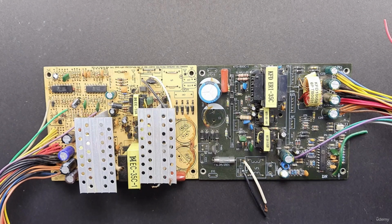The first step is to turn off power and discharge any capacitors in the circuit. Now the next most logical step is to check for fuses. Fuses help to isolate electrical equipment from power during abnormal conditions. An appliance that won't turn on may be due to the failure of a fuse.